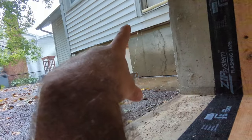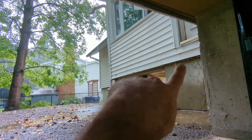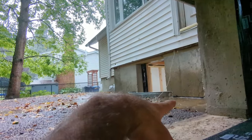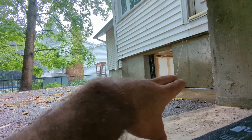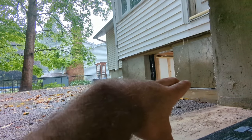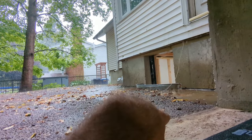It's why we don't let the dirt come up against the siding. See a lot of houses when you drive around, the dirt's like this. Well, that's splashing all up here, and it's splashing all up onto the wood there, right? And then you get mildew growing, and it ends up getting soaking wet and staying wet, and the humidity from the dirt. So we like to expose a lot of foundation wall. See how we run out of the splash zone here? But we really don't want to see any more of that. If it's acid rain, if the pH is eroding on the block that was here, I don't know what might happen. Maybe the whole block foundation could collapse and cost you $200,000 to replace.